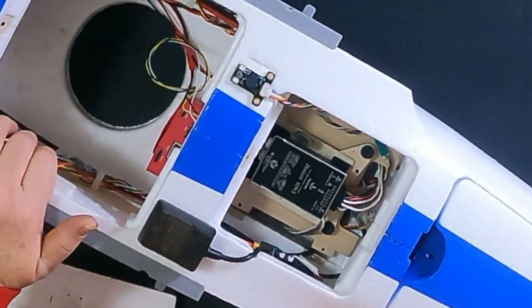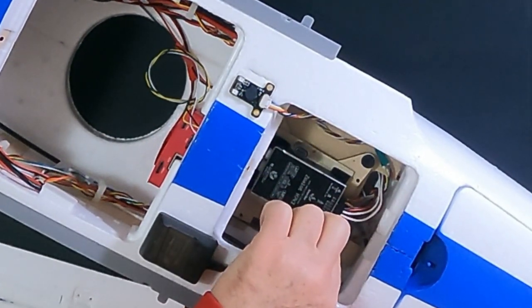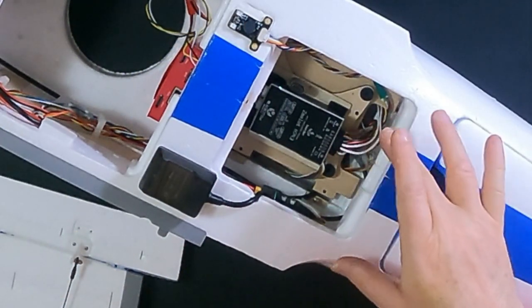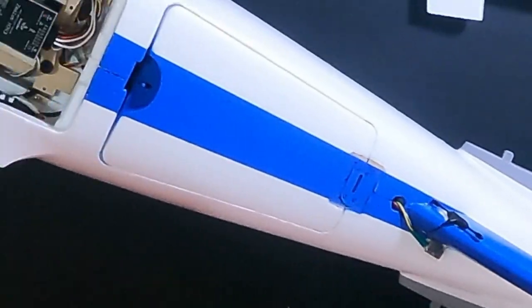The four motor wires run in through the wings via quick-release connectors and are wired into channels five, six, seven, and eight. I decided to run separate wires for the ailerons rather than a Y-wire, because it gives the ability to separately trim each aileron — you can trim the center point and the max independently since they're on separate channels on the flight controller. So the channel layout is: aileron, aileron, throttle for the forward motor on channel three, channel four is rudder, and channels five through eight are the four lift motors.